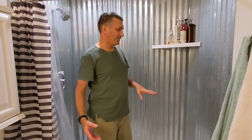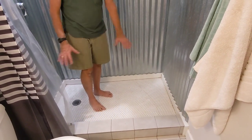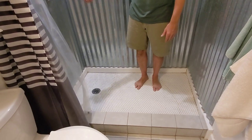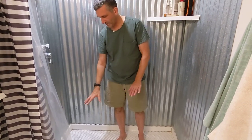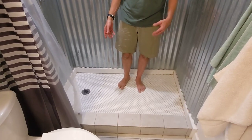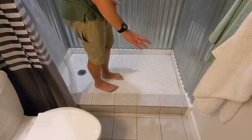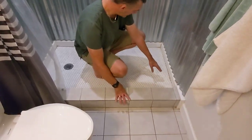But I'll discuss what I did down here because the cost of materials was really cheap. This is just a standard mortar floor — membrane-first mortar floor. I put a drain in that I had roughed in. I knew which way the showerhead would be pouring, so I wanted the slope to go toward the center. And then these are Home Depot penny tile sheets, which were really pretty cheap. I made a curb out of some 2x4s here, wrapped and tiled that, which is normal.